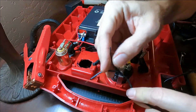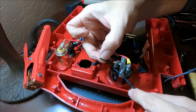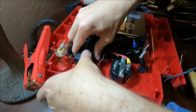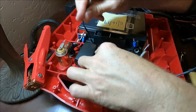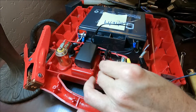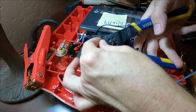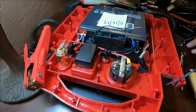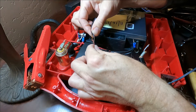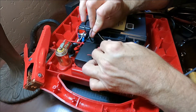That just showed me that the white wire is the positive one. So I trimmed it down and stripped the wires. I fit my plug in its nice snug hole now. I'm going to clip off both the leads of the positive and negative original transformer, and splice the red wire to the white wire and the black to black.